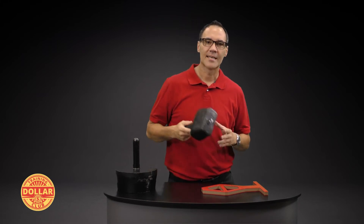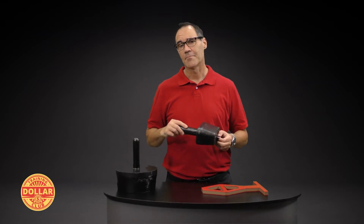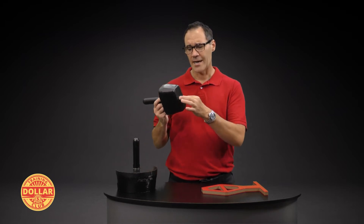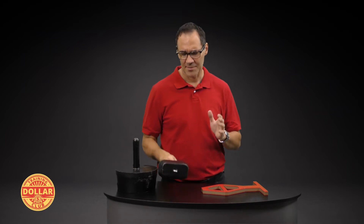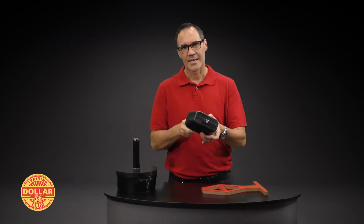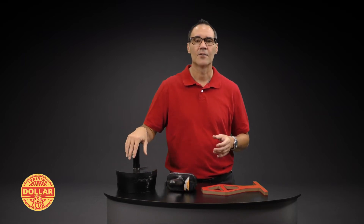We'll look at Joan and Jamie out here testing some fully bound rigid openings. And again, these can be used on our fully bound flexible openings — so that's the 3D net climbers. The eyelet is for hooking your pull/push meter and pulling it through up to about 50 pounds or so. If this gets stuck and I can't just easily push it through — if I have to wiggle it or force it — I will always write it up to see if an adjustment can be made to either prevent it from going through or open it up enough that the head can also go through.